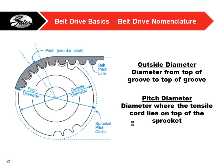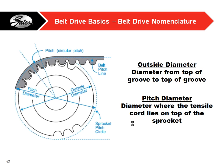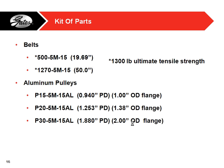A quick note on nomenclature: when I list pulleys, they're all in PD, which is pitch diameter. Pitch diameter is where the tensile cord rides on the pulley, not the outside diameter — but they're really close together. You also want to watch out for the flanges on the pulleys, because those can add a little more to the outer diameter. So if you're fitting into a certain space, make sure you account for the flanges.